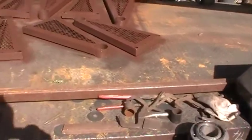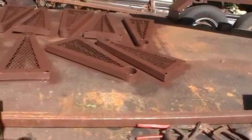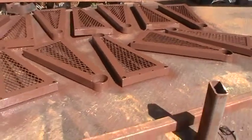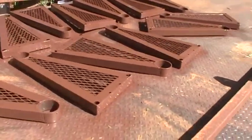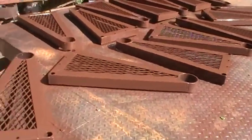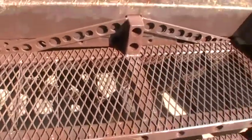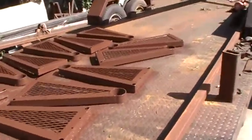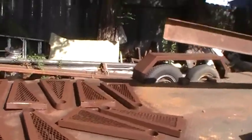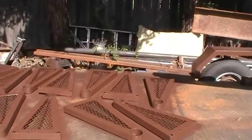I've been thinking about how I'm going to support it, and I figured I would do two-inch flat bar. Since people are just going to be walking around up there, I'm thinking two-inch by eighth-inch flat bar, which is what I used in here as the strong back. That little thin piece in there is two-inch by eighth. I was probably going to take quite a bit of that flat bar set on edge to support each sheet.